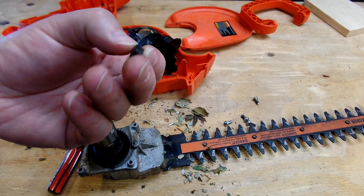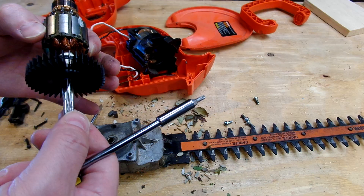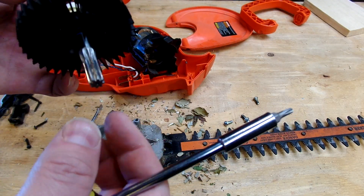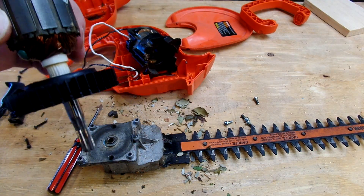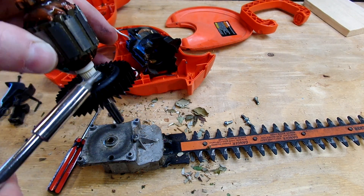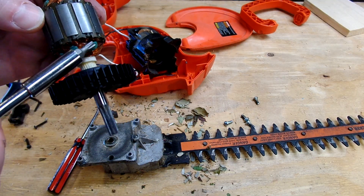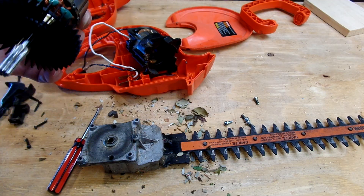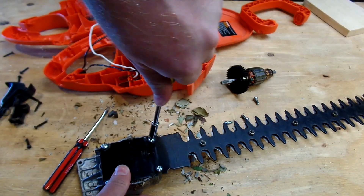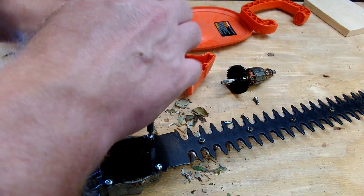And we dropped the brushes — they look pretty decent, no scoring, not really destroyed. A little bit of a fan to blow the air around. Heavily geared, directly milled into the center shaft of this motor — that's pretty neat. There's a little epoxy down there, some kind of hard plastic. They use little bits of glue to balance the motor — that's pretty smart. And then we have a gearbox — we can peek in there too. Just ignore all of the bush trimmings spilled out everywhere.